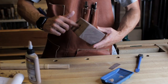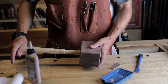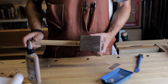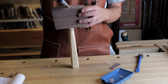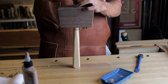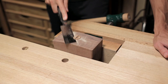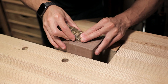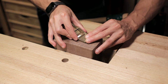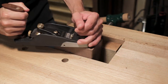Now finally, the assembly. The handle is maybe slightly undersized but it was a relatively easy fit, and it's a little bit long so I'll trim that off later. I make sure to add a little bit of glue to the wedge at the top, then go ahead and hammer it down. Mine actually cracked — it was pretty thin and cracked when I was hammering, but luckily it was above the head. I'll come back with a flush saw and clean it up with a block plane, then switch to a smoothing plane to make sure it's nice and smooth at the top. It adds a nice look and should keep it relatively tight.